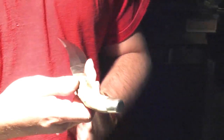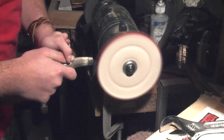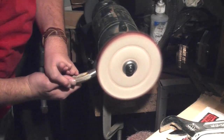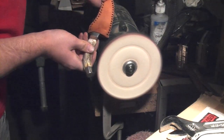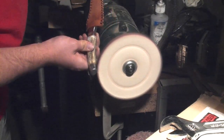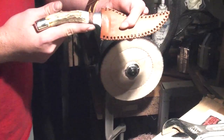Here's the result of that — he's been sanding on it for some time now, getting just the right contours. The buffing wheel has got some Jeweler's Rouge compound on it, which makes it cut through the pewter real easy, and it leaves a nice wax finish on it.